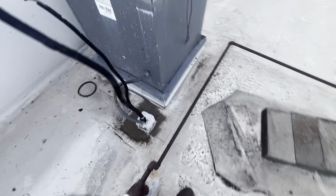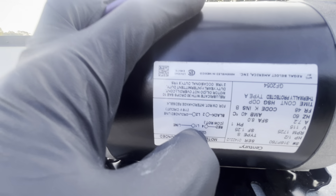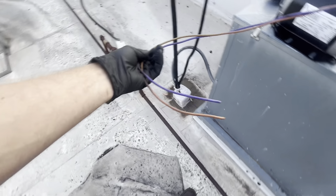Given that once I mount this I can't get to the electrical section worth anything, I'm going to make sure it is wired for clockwise rotation currently, because the red was on four. If you need to reverse it, you just reverse the little red and blacks in there.